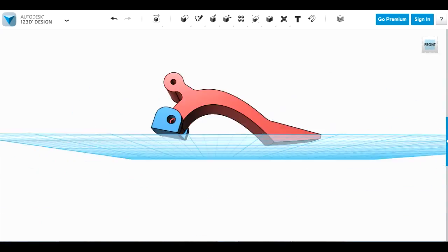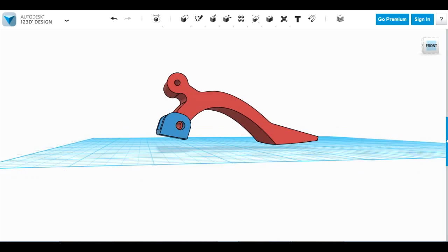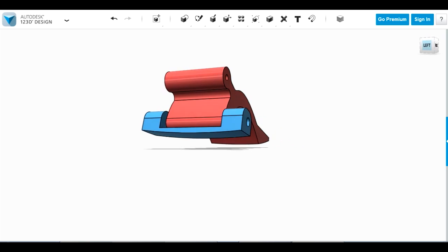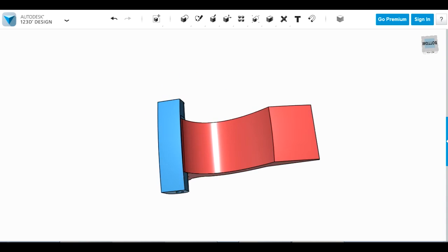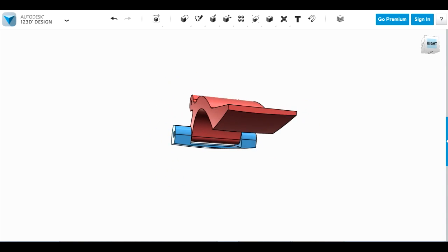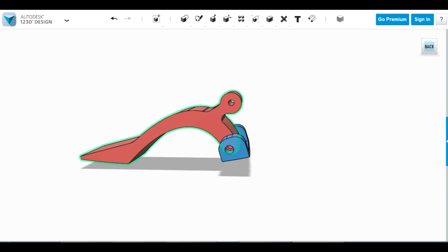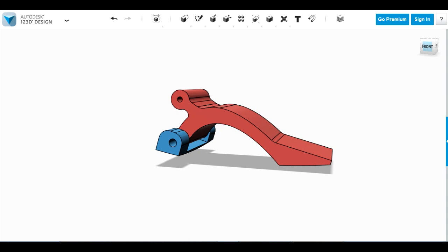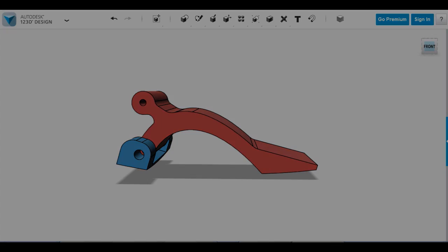I've designed this hinge here, which will hopefully hinge those panels out properly — it's curved so it can reach around the edge. I've made the contour on the bottom at just the right radius in all directions to fit inside the ball, so they'll fit inside the panel and the frame of the panel with slightly rounded bottoms. The idea is that the servo pushes the top red hole and that causes the thing to pivot round — this is something commonly used on R2-D2 dome panels, a similar design to this. Let's get this printed and stick it on.